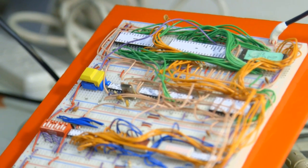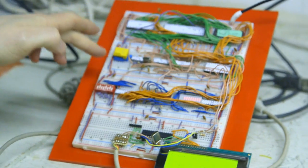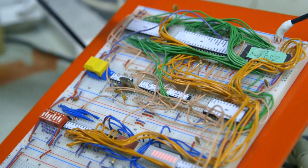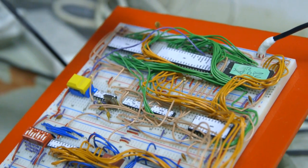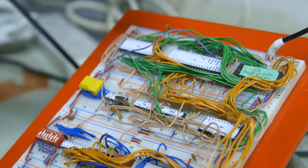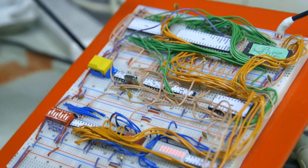That to me looks like a pretty complicated thing. It's colour-coded to a reasonable extent. The red and purple wires are positive and ground, so that's power. All of the green wires are the address bus — the CPU address bus goes off to the RAM and off to the ROM. A bit of the address bus goes off to the communication chip. There are 16 lines of the address bus, which means the CPU can address up to 64K of memory, so every byte has a unique address within those 16 lines.